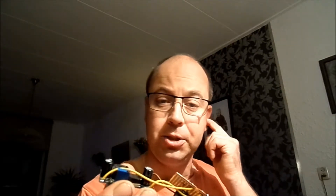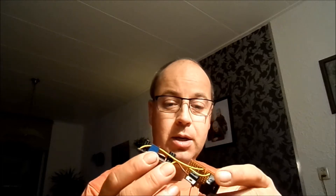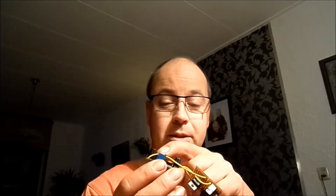I'm also using one of my buck converter power supplies. I've set this to 12 volts, and it goes to this linear voltage stabilizer, which is 5 volts. That will supply power for the Arduino and also for a light in the bathroom and maybe some other functions. Why 12 volts on the buck converter? Well, this LED light strip is 12 volts, so I need to switch that.